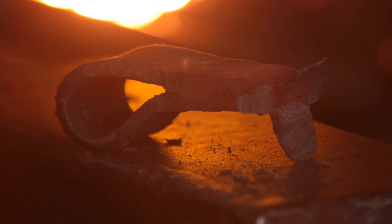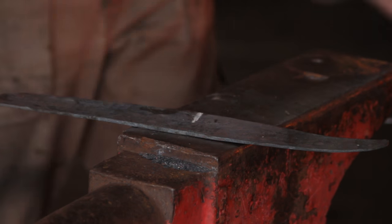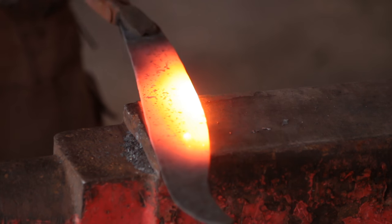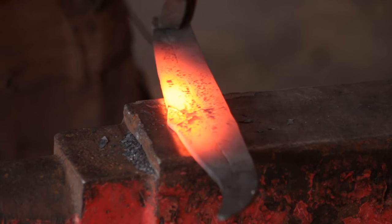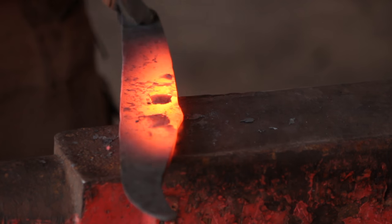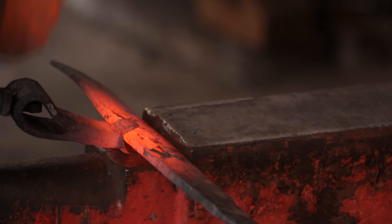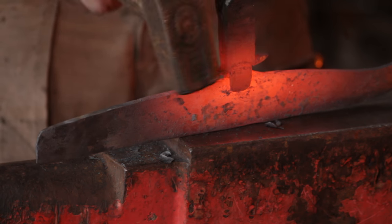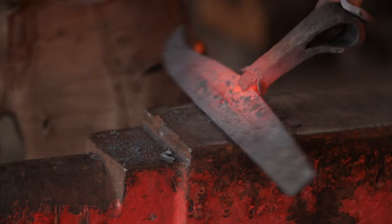Here's the eye ready to be mounted. I take the blade from last week's video and mark up where the eye sits from the drawing, then center-dot that mark to make it easy to find — I can't show the drawing as I don't have copyright, but I'll stick a link in the description. I put a little scarf on the blade — not particularly wide, just the width of that chisel cut on the eye — to make it easier to weld and seat. If I'd made those tabs a little bit longer I'd have found it easier to seat, and I think I should have done some little notches on the blade itself like I do when edge welding — a note for next time.